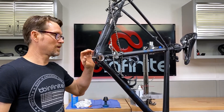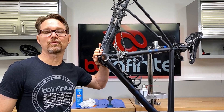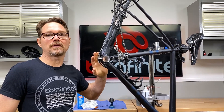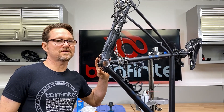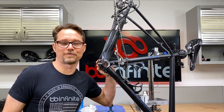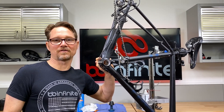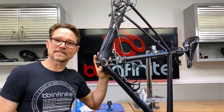Picking up on the themes from our last video, we have cleaned this bottom bracket out right here and we have measured it and we have determined that it is way too small. It's about five thousandths of an inch too small — that's like 0.1 millimeters. That is so small, nothing will ever work in here. This bike will never be any good, believe it or not. So we have to fix it.